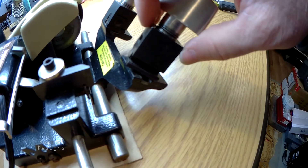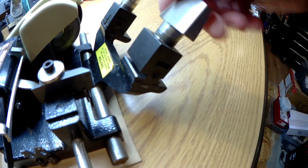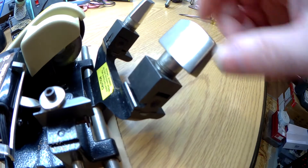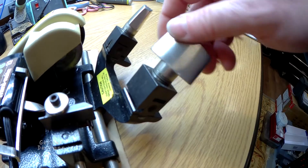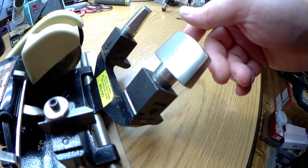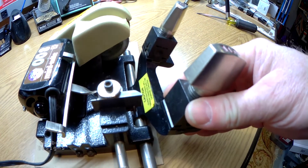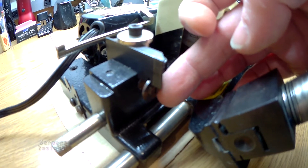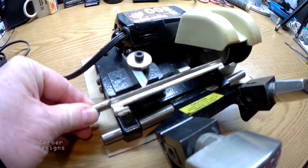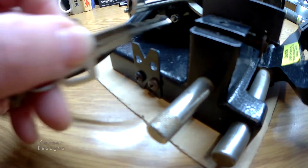This model has a reversible key jaw. The knobs on this model have thrust bearings, which make for a nice, smooth operation. The carriage on this is manual — you have to slide it and move it up to cut the key by hand. The cutting depth is adjustable, but with a screw. This model also has a flip-down stop to align the key shoulders to get them both in the right position, and it has a rake for deburring the keys.